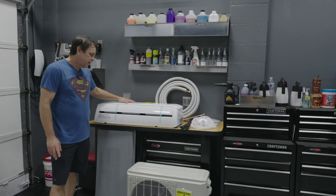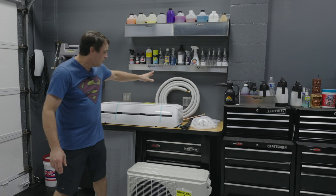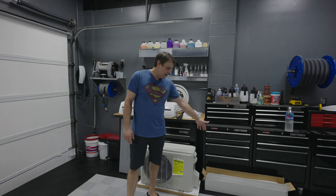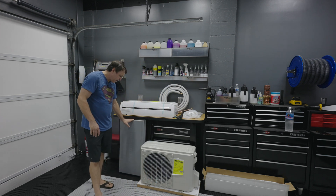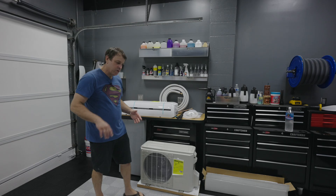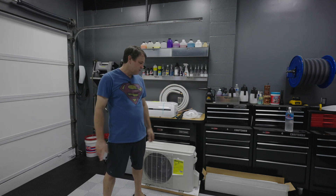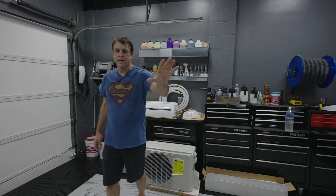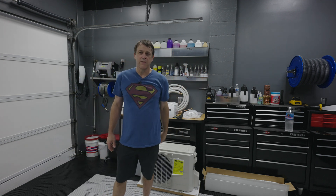It's a nice looking outdoor unit with a modern-looking indoor unit — very good looking, very quiet, works well. This kit comes with all the plumbing, accessories, and wiring between the two units, as well as a line-hide kit that hides all the plumbing outside. What it does not come with is a mounting pad — I chose to go with a plastic one on the ground, though you can also mount it to concrete or elevate it on a 90-degree bracket. It also does not come with any of the major electrical work needed to run the breaker down the wall to power the unit at a disconnect.